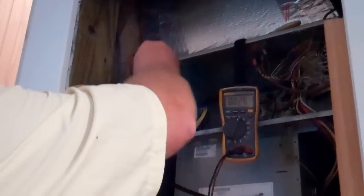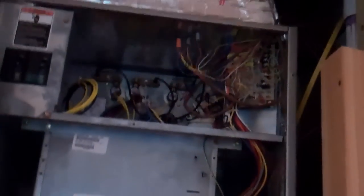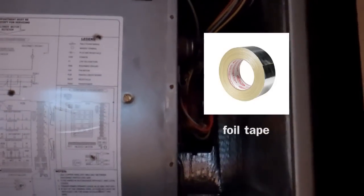Power's all off on this breaker. We drop her in off the top. We're going to make sure that we don't have any voltage here — always be safe, always think ahead. If you see right here, we've got some wiring that UV-C will break down the coating on. Go ahead and cover that wiring with some kind of foil tape — it's all about making the wires last a little longer and keeping them from breaking down from that UV-C lighting.